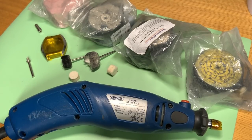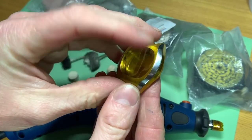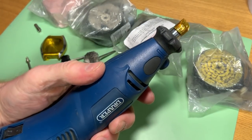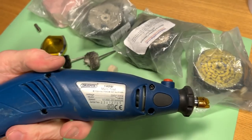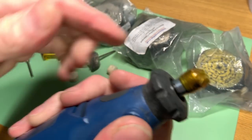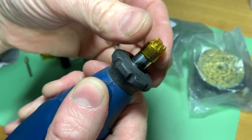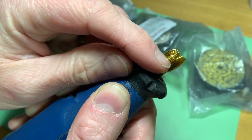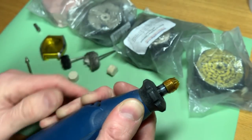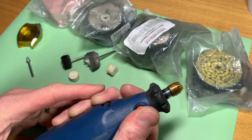I've masked the case off and exposed just these two pieces to polish for now. If you're going to use a machine like this, always check the collet end — this one is knurled, and if you slip, the knurling hits the case and marks it and you have to start over. I've put some tape around that to protect against it.